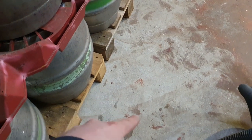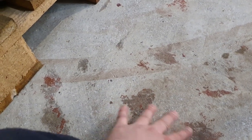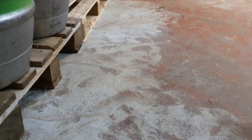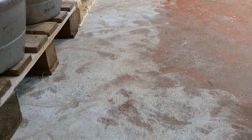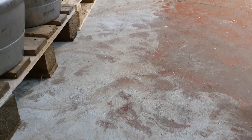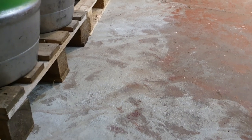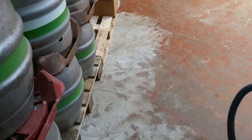All the little bits of paint that are left here - well, these are all the divots. So you want to work around the divots and eventually the divots start to move. We don't want to be completely abrading the whole floor down to nothing, but as soon as we feel like we're getting level then we'll move on to the next bit. The quality of the floor is really quite old and bumpy, and I'd be here all day if I wanted to get a snooker table finish on it. So we're just going to get it stripped of the old paint and expose the old concrete, so when we prime that and put the resin bonded epoxy down, it should last for decades.